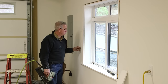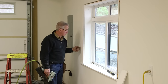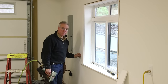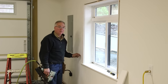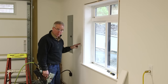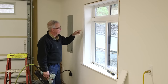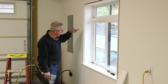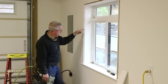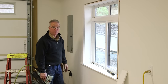Let's talk about nail length. I'm using a 2.5-inch 15-gauge electroplated galvanized nail. I've got to get through 3/4 of an inch of trim and half an inch of drywall — that's 1.25 inches — which leaves me a full inch and a quarter of embedment into the king stud and the trimmer, the two framing members back behind here. I can get some really good connections. I'm not going to try to run a 2.5-inch nail through the edge of that board into the edge of this one; I'll shorten it up so it doesn't hit a knot or crooked grain and dive out and make another hole for the painter to fix.